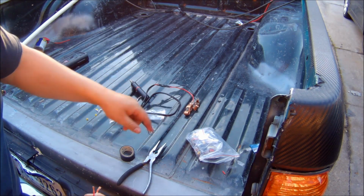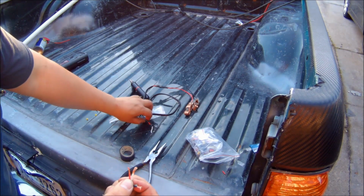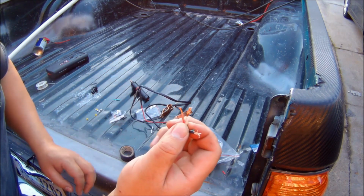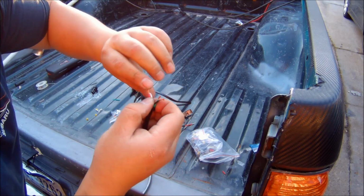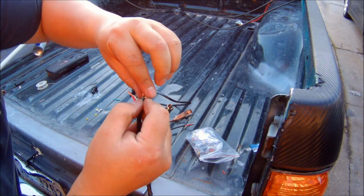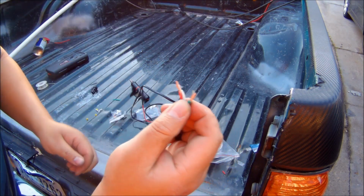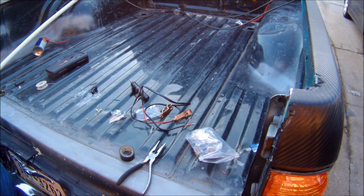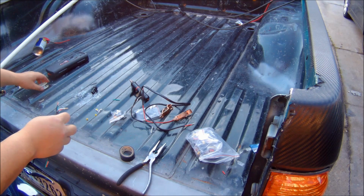There's the alligator clips to clip on a battery, and then in my right hand is the wire that I'm going to use to make two different plugs. In this situation, the red and the white is going to be my hot wires, so that's for the positive, and the black and the green is going to be my ground wires, and I'm going to go ahead and solder those onto the gator clips that will go onto the battery itself.